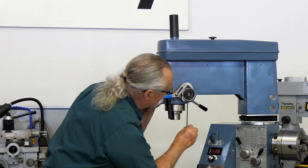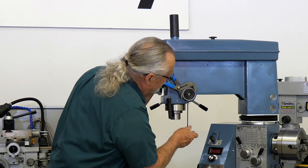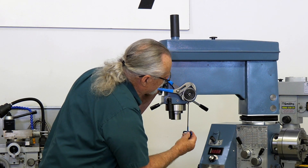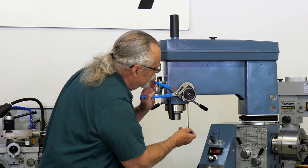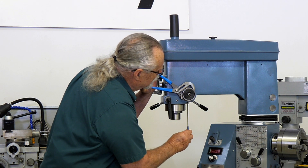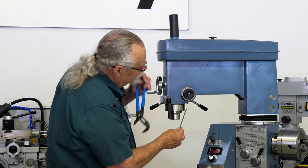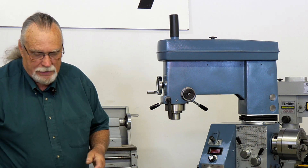Loosen it up. I'm going to turn it around. There we go. See how it moves? Just lock it a little bit. Turn it some more, and look for that next detent. Not quite there. Last turn. There it is. See how it's going in? I moved just one detent — those detents are all around the outside of this piece. So put the set screw in and tighten back that a little bit.